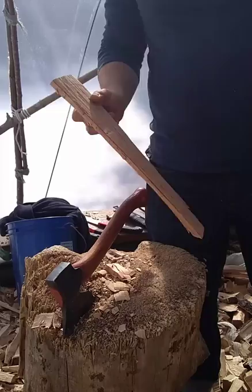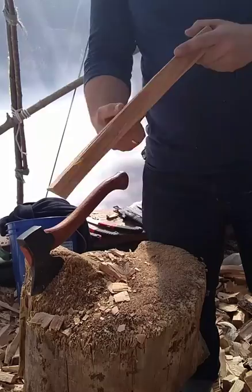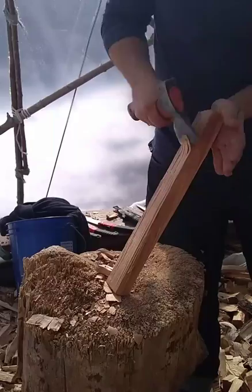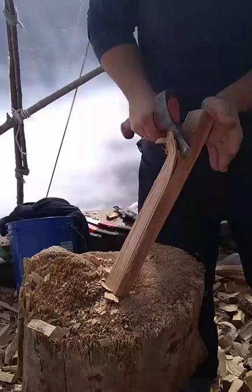So to some extent, if I'm making something with a piece of wood that has a thinner end and a fatter end, I'll orient the spoon on the fatter end, and that gives me more room to tip the bowl of the spoon down in by making these crank cuts here. You see how my fingers are held stiffly out and back here. They're not wrapped around where I could hit them with the axe. Always be aware of what the axe could do.